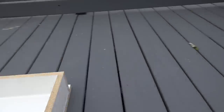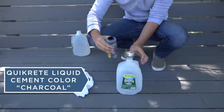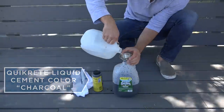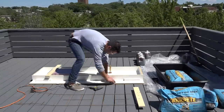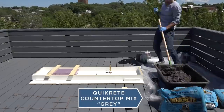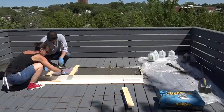It's always a good idea to double check the entire mold to make sure all parts are nice and sealed. I want the concrete to be a nice dark gray so I'm going to add half a bottle of Quikrete liquid cement color to each gallon of water I use. I glued some sanding pads down to the melamine mold because I'm going to use an orbital sander to vibrate the concrete later. I used Quikrete countertop mix for this project and mixed each bag one at a time using water that already had the liquid cement color mixed in.